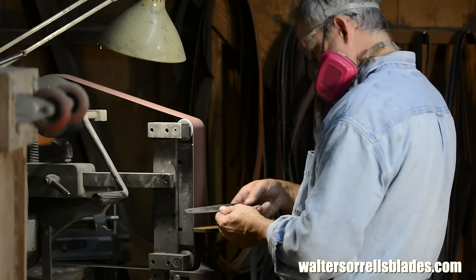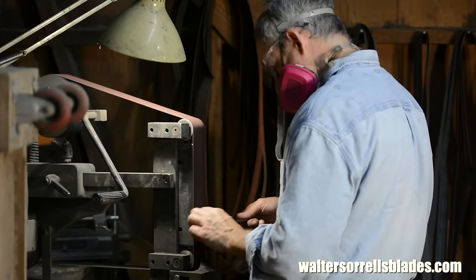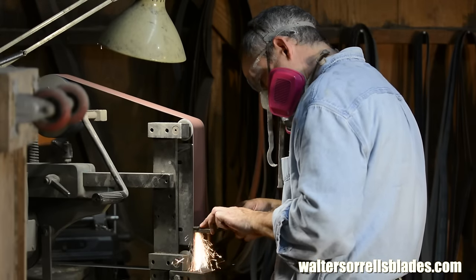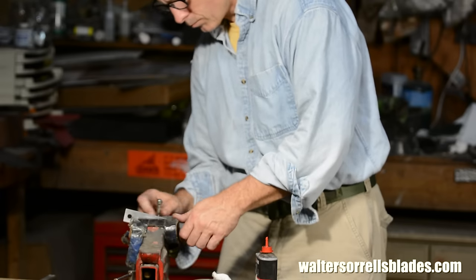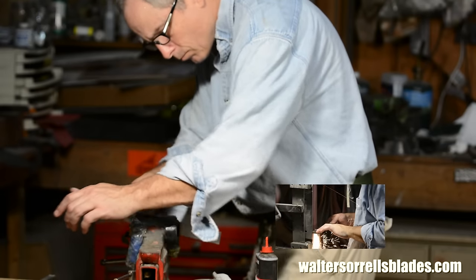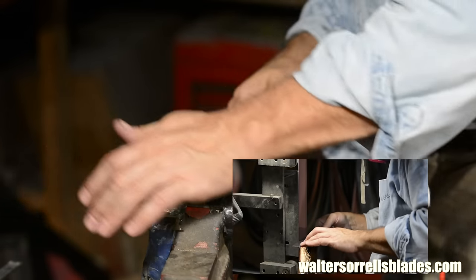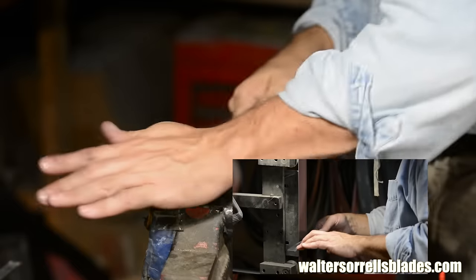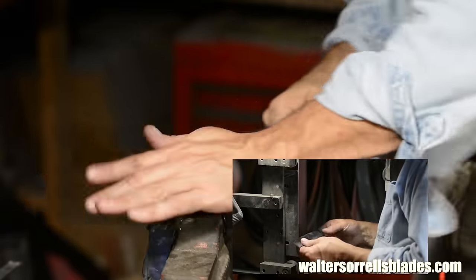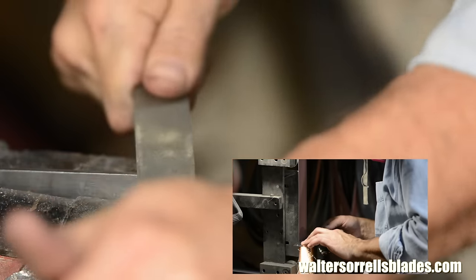The pros will now go to their belt grinder and grind out that shape, or maybe they've already cut it on a water jet, CNC mill, or blanked it with a giant press. But you can do this whole thing with a standard double-cut bastard file — about $10 at the hardware store. Grinding it on a belt grinder will take 4-5 minutes. Doing it with a file? I'm not going to lie to you, it'll take a while. You'll get tired and cranky and possibly throw your file at your dog. But if you start early, you can still have this part done by 10 o'clock in the morning. You'll be amazed how much steel a bastard file can remove if you really put your back into it.